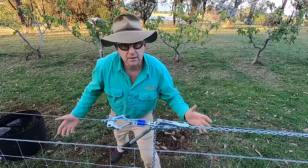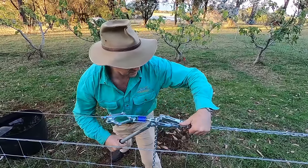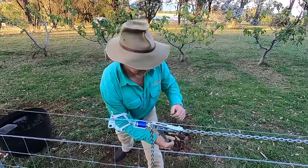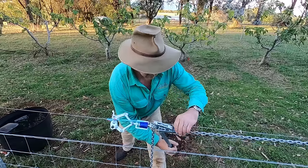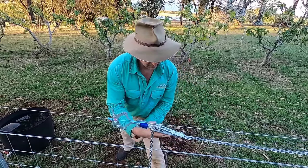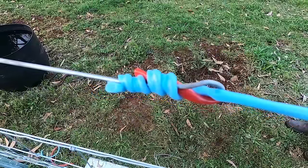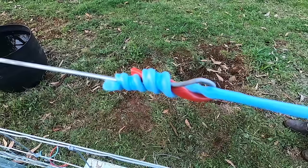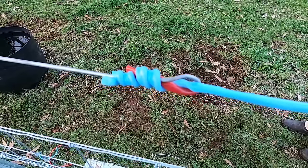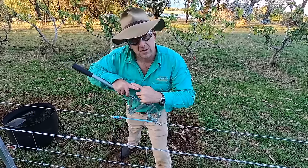Keeping our safety gear on and making sure that no one else is around the fence, we can start to undo our strainers by forcing them a little bit further and letting them undo themselves. They might need a little bit of a hand gripping the chain on their way back. You can see that this knot is holding even with the spaghetti tube over the top — and that's because it's actually a compression knot, not a tension knot. As this gains strain it will actually close up even more.